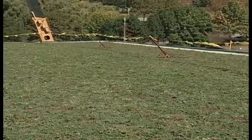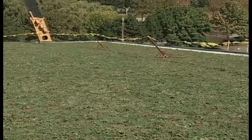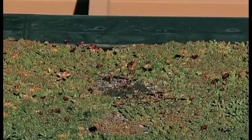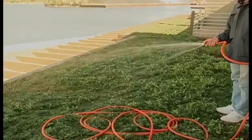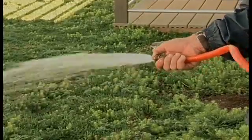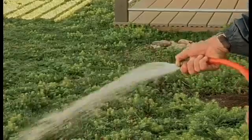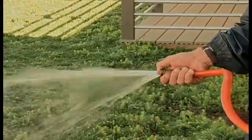With protracted warm or hot weather, plants can potentially be killed. Even dormant plants, which return to a growth mode when conditions become favorable, will shrink to a smaller size and expose soil, which can predispose the plantings to weed encroachment. When hot, dry weather persists, thorough irrigation is recommended and should be conducted to the point of runoff. This allows the plants to avoid dormancy, cover the soil effectively, and keep the evaporative cooling effect of the green roof working.